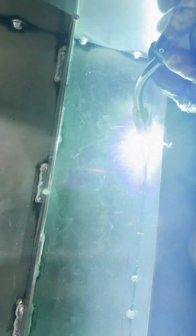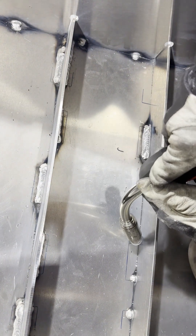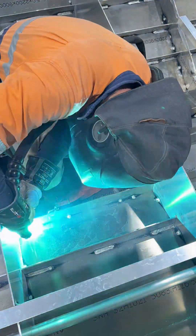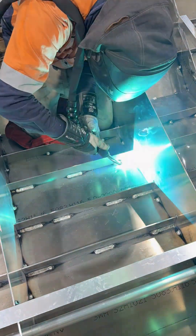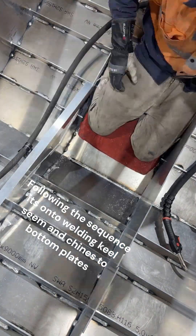As far as running the MIG goes, it took a while to get all the settings right, but I dialed it in at about 165 amps for the fillet welds in the flat position, then changed throughout the progression of the hull as the angles started to change. The settings change a lot between different joint configurations. Anything edge-to-edge was certainly a lot harder to weld than any of the fillet welds, but turning the volts up and the amps down a fair bit definitely made a big difference.